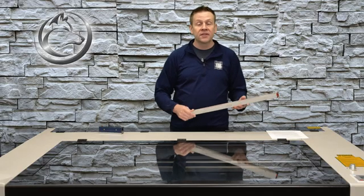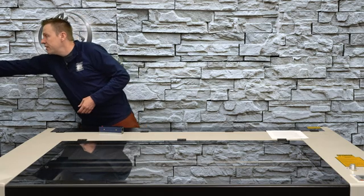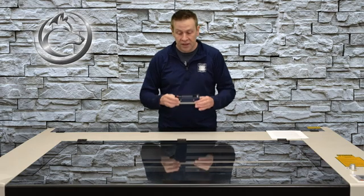This completes the first step of the leveling method. For this next step, we're going to pretend that I let my machine settle overnight. I'm going to set the carpenter's level off to the side because I don't need that anymore. For this step we're going to be using just the machinist level, and we're going to be repeating the same process — checking the level in this direction again.